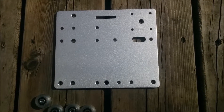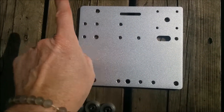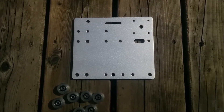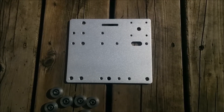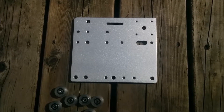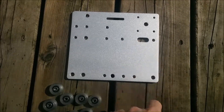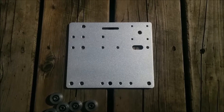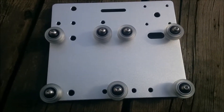So make sure your placing of the plate is right. You want this hole up at the top, left-hand side. And then we're gonna do the same thing we did with the other plate — where you use the regular spacers along here for the holes, and then the eccentric spacers at the bottom. When you're done, it should look like that.